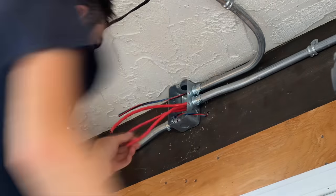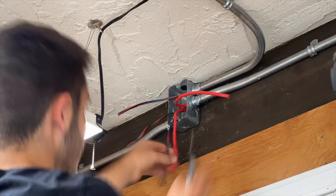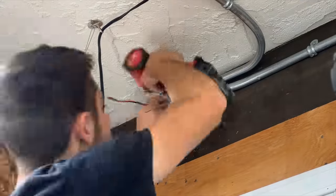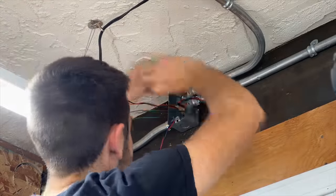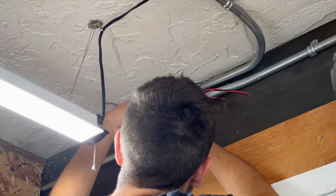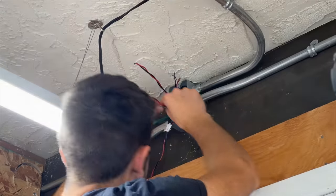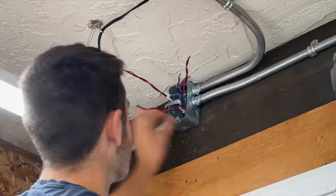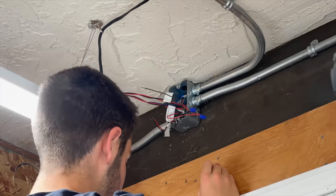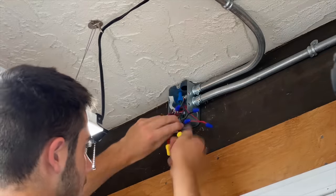I, for some reason, didn't think about that this wasn't the end of the circuit. For some reason, I had it in my head that it was the last device, but indeed the bedroom smoke is the last one, not that one, so it still needs 4 wires to be used to carry the communication as SLC into the detector and SLC back out, because I'm not T-tapping this. Even though it's addressable and it would be monitored, you still don't T-tap, because if you've ever tried to troubleshoot a T-tapped addressable system, it is more of a pain than a regular.